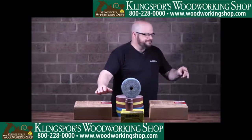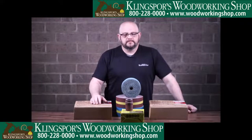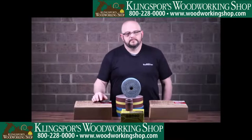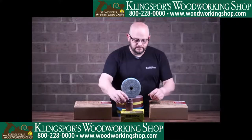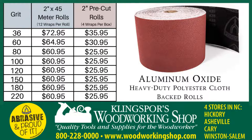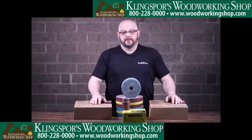A lot of places online — Supermax or Jet — have Klingspor abrasives inside the box labeled by those manufacturers. Klingspor abrasives has been supplying drum sander wraps for years, decades at this point, so if you're used to that quality you'll have it consistently, but you can also get it from Klingspor's Woodworking Shop at a fraction of the price. For a 2244 Jet oscillating sander we stock the 3-and-1/8-inch by 18-meter rolls, available in 60, 80, 100, 120, up to 220 grit. For the old Delta 1836 needing 2-inch wraps, we have the 45-meter roll giving about 12 wraps, or the pre-cut giving 4 wraps per box — so three times more wraps for just over double the price.